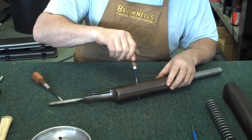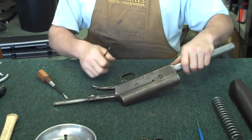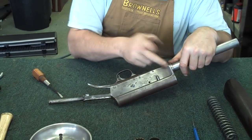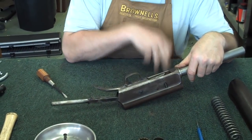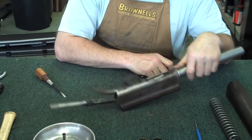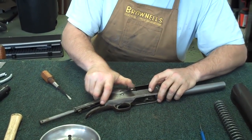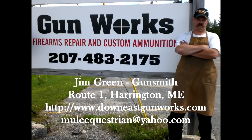Something you're going to notice about the Remington versus the Browning A5: the Browning A5 is going to have a little latch right over here on the front that's missing on the Remington. All that is is a magazine cutoff. You flip it in one direction and it does not allow the ammunition to feed, turning the gun into a single shot at best. Or you can flip it back and it will continue to feed from the magazine. That's basically it as far as your disassembly, and this is the only trick you need to know for reassembly. Thank you for watching this latest Gunworks video.